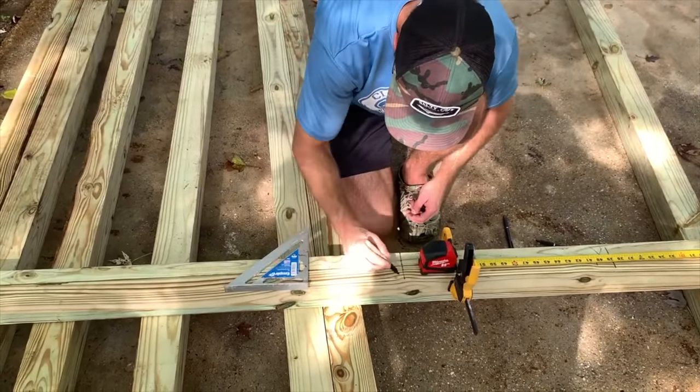After you've cut one side free, you're gonna move on to the other side and you're gonna cut that other side of the bottom plate free. And again, use your reciprocating saw and cut straight down along that stud. Continue to use a reciprocating saw until you cut all the way through the 2x4. And once you get all the way through it, you'll be able just to use your hands to lift that bottom plate out of place. Here I am checking to make sure it's loose. And then I'm moving here to the other side to completely pull it out of the opening. Once you've completed that, you're pretty much done.